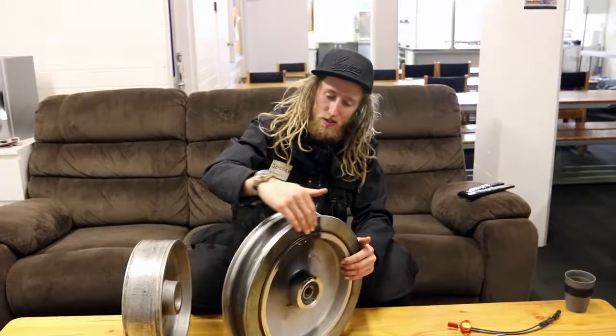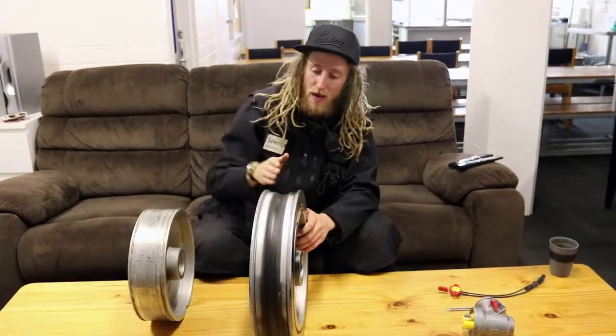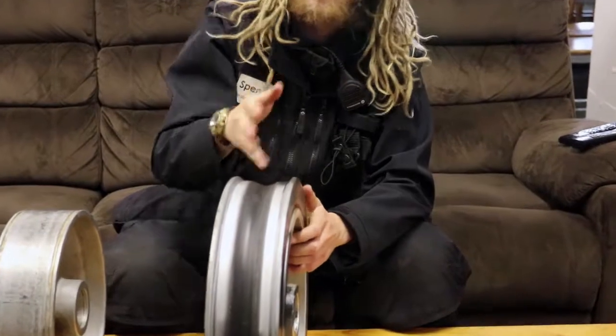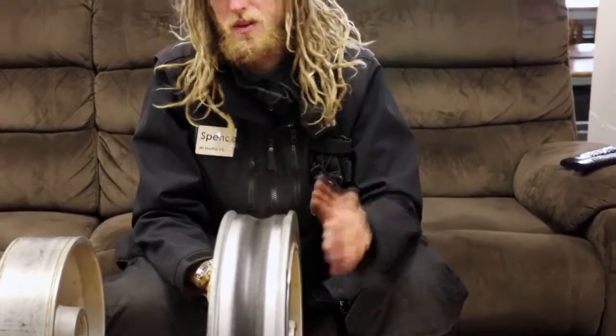As you can see, this whole side part here is all metal, but right in the middle this is rubber. What can happen is if this is stuck and the cable of the chairlift is grinding over this rubber here, it can cause a flat spot and then that's going to need replacing eventually.